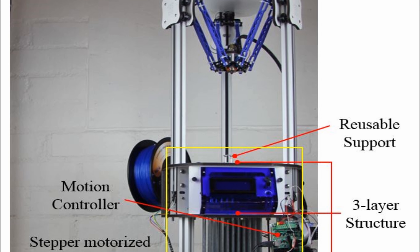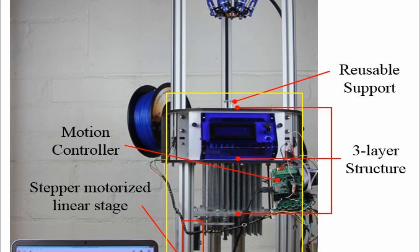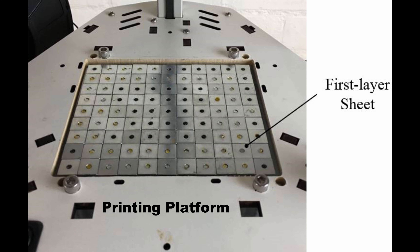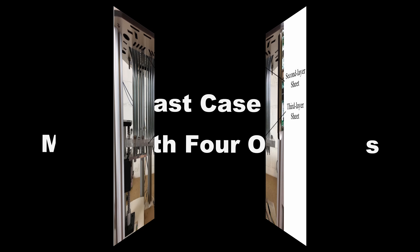The main idea is to use a single motor to drive a large number of pins serving as a movable printing platform to different set heights. The pins will be lifted if prefabricated hollow tubes of standard lengths with magnets are inserted from the base into the pin rods.